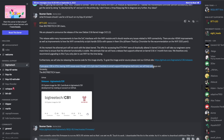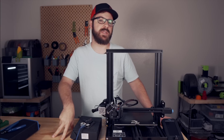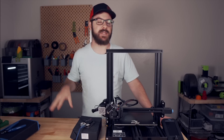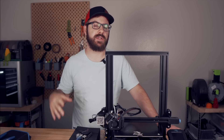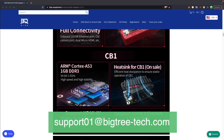Around this time, I saw Bigtree Tech reaching out on Discord as well as over on GitHub to users that were having issues with their CB1. When I spoke to Bigtree Tech directly after updating to the latest version and still having issues, they said they were actively looking for users having issues with the CB1 on this latest build. They ended up revising the pins on the CB1 that were causing issues with the wireless network, and told me that anybody on the latest version still having a wireless connectivity issue — they will swap out your board for the latest revised CB1. They want you to send a short video showing you're on the latest kernel version and having a networking issue to support01@bigtreetech.com, and they will get your CB1 swapped out.